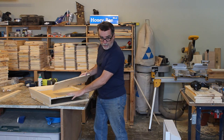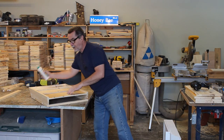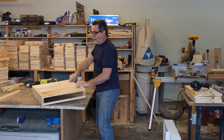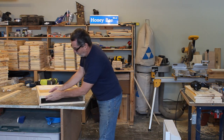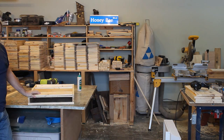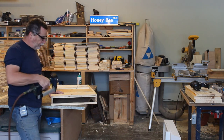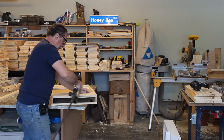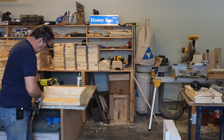I put the 14-and-a-half strips on each side, then the 20-inch piece across the back to tighten everything up. I use my thumb and forefinger to make sure the strip is sitting on top of the board underneath, then drop one air nail in and do the same thing at the back to stop it moving on the glue. There's also an 18-and-a-half by half-inch thick piece that goes across to stiffen the plywood and prevent warping. I use an air stapler with one-inch staples, angled slightly so they don't shoot straight through.